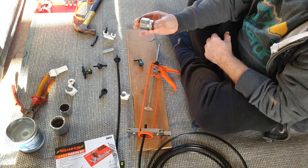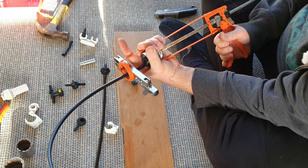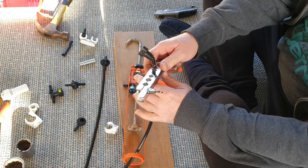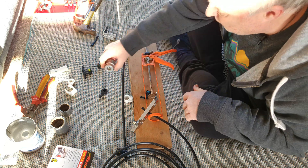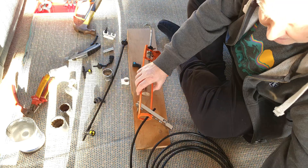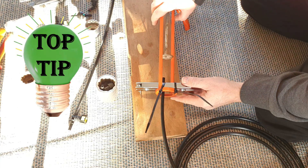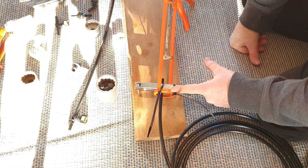You may need a different size of socket if your fittings are a different size. Bring the fitting to your pipe — a nice big socket makes it easier to use your other hand to keep it all square and straight. If you don't get it perfectly square and straight, you'll just crush the pipe. Keeping it rigid and straight is very important, and something I found of great benefit was tie-wrapping the pipe holder to the end of the caulking gun — it saves you a lot of work with your hands.